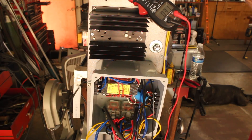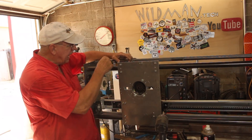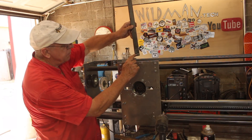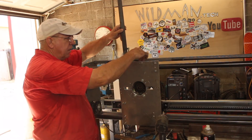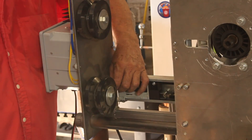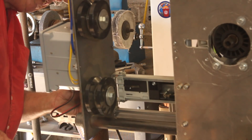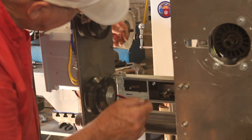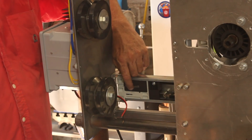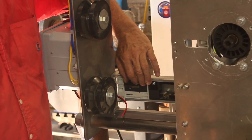There are only a few things left on the gantry. On the slide, we need to build an arm to engage these limit switches at the ends — I'm going to make that from this piece of 3/16 bar. I've already drilled the holes and tapped threads into the bar, then I'll bend it up and over so that even if it flops around a little, it'll still engage the switch. I also need to interface to the motor. I thought I was just going to solder to that spring tab, but it turns out it's stainless steel and doesn't take solder well.